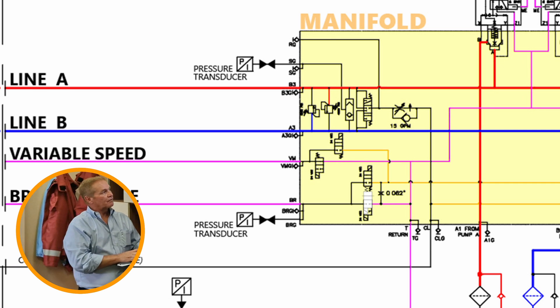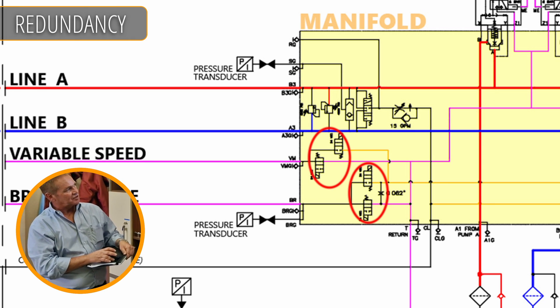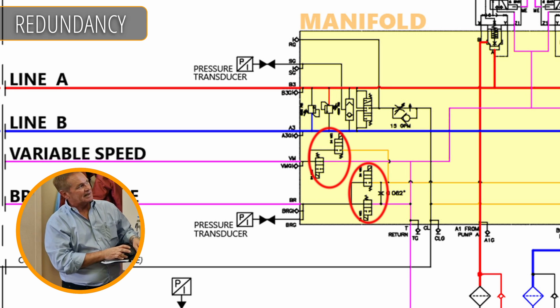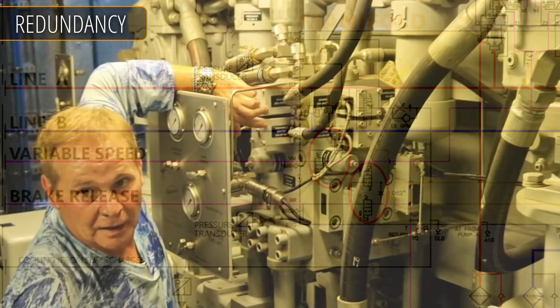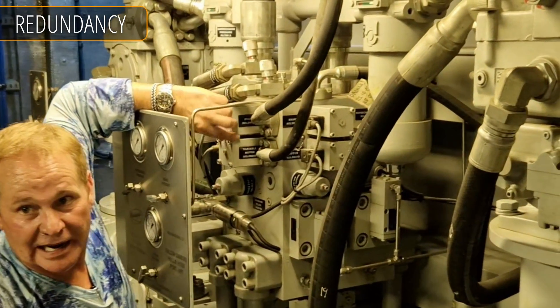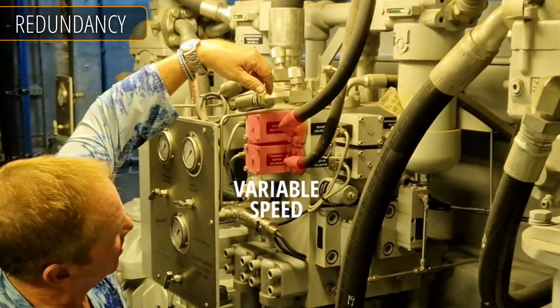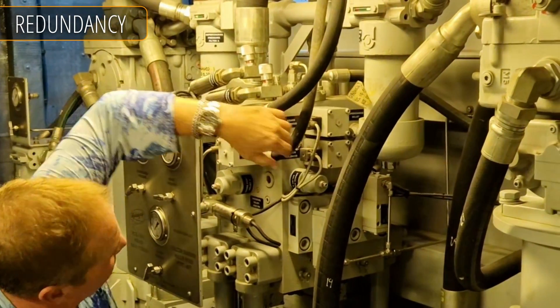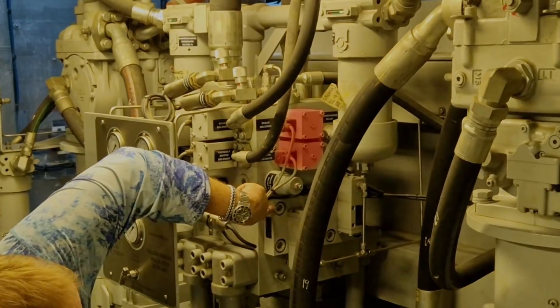What's important to know is that the brake valves and the two-speed valves are identical. So if we were to have a problem with a solenoid or a poppet in our brake valve, which is critically important, we could swap these parts — because our two-speed is a luxury item. We can travel at normal jacking speed, but you can take the parts off the two-speed and put them in the brake, and then we can release our brakes again and we're back active.